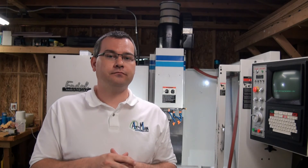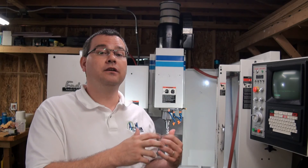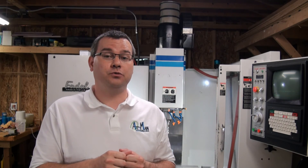When considering a machine like this, we also need to make sure we have enough power at our house and in our shop to run it. Using a phase converter to run this machine on three-phase would draw about 80 amps off a single-phase 220 circuit. My house has a 200 amp service and I ran a 100 amp subpanel out to the garage. Running this machine on single phase, we're only drawing about 60 amps — the maximum we can draw through the variable frequency drive on single phase. The machine also requires a compressed air source, so we need to run an air compressor while the machine's running, plus keep the lights on. We have just enough power to run the machine, the compressor, and keep the lights on.